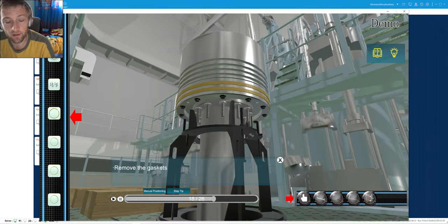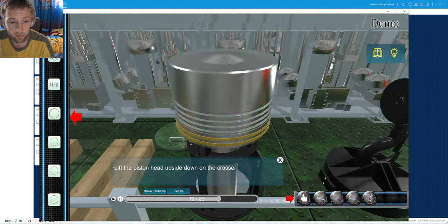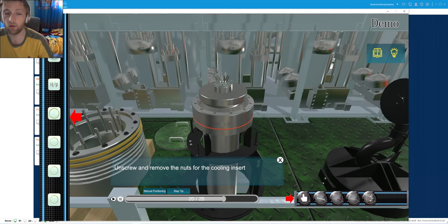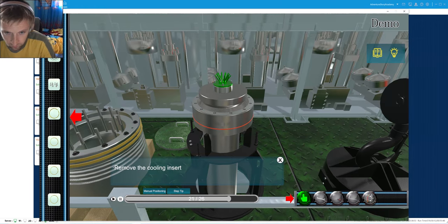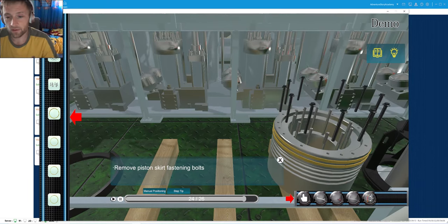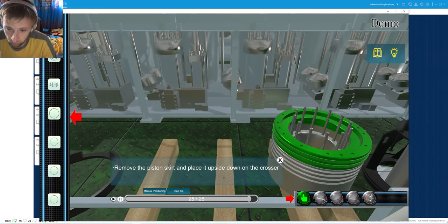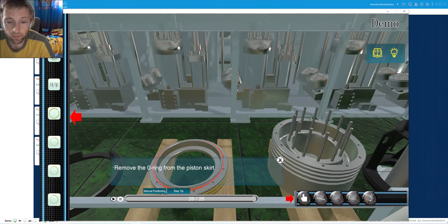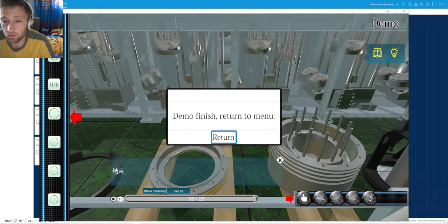There is also release of the hydraulic nuts on the bottom and we pick up the crown. Here are the nozzles which produce the splash effect and the oil spreads around the piston crown. There is overhauling, cleaning and checking procedure. The cooling oil pipe will be removed, and the oil ring will be removed. The piston skirt is also removable - if there is big damage it can also be replaced. O-rings are also removed.